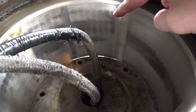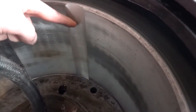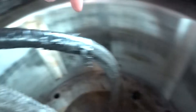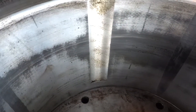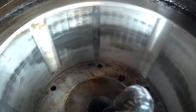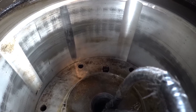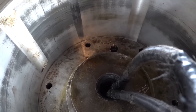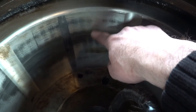So we're up here on top of the generator, and you can actually see this is a bearing. A neat feature to notice: these grooves here are oil pockets. You can see two of them — the oil drains out the bottom on two, and on the other two it actually traps oil, keeping that full. This assembly is stationary and that assembly is rotating down there — that is the big main upper bearing. How do the bearings work? Here's the top bearing — it's a billet babbitt bearing. It's billet because it's made from one piece of metal, made out of babbitt bearing metal.